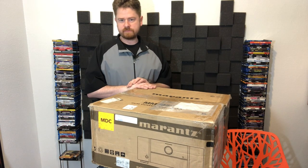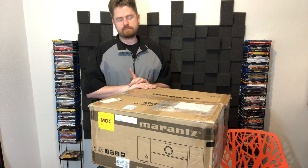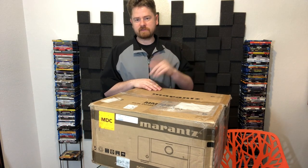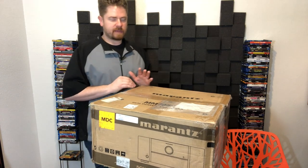This amplifier is the MM7055 five-channel power amplifier. It's rated at 140 watts at eight ohms and 170 watts at six ohms. Surprisingly, it's not rated at four ohms — I didn't know that until I got it home and started doing a little more research, so I'm not quite sure how I feel about that. I did read the review from Audioholics — Gene over there is fantastic, by the way, you should definitely subscribe to his channel. He calls it out in his review too, that it wasn't rated at four ohms — not on the box, not in the paperwork. But Marantz apparently says that it drives four-ohm speakers just fine.